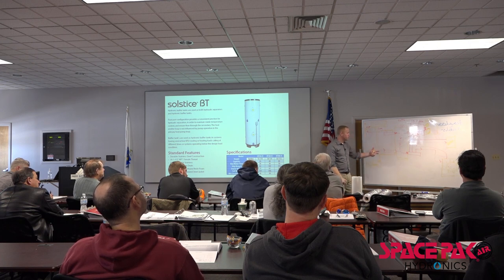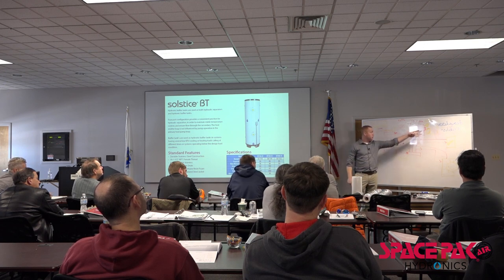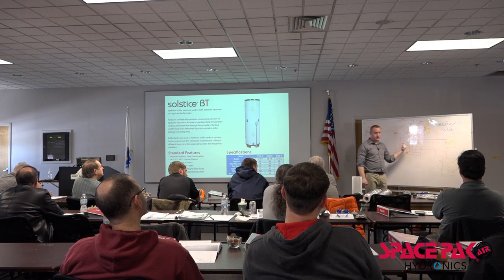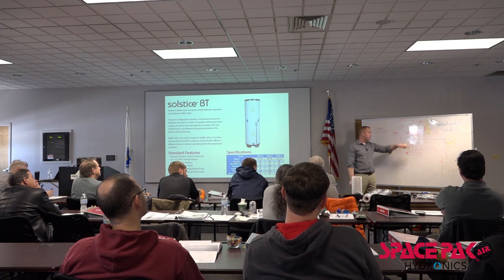When any one of those runs, and this temperature through our control, maybe we have a 5 degree differential built in, maybe we leave it at 5 degrees. When that temperature in that tank, the sensor's right here in the middle, gets to 120 degrees, what's it gonna do? It's gonna turn on one of these forms of heat, right? Turn these on as the charger for this said battery. So depending on what we're doing, depending on how the system is set up, it can be very basic.